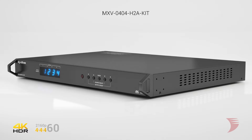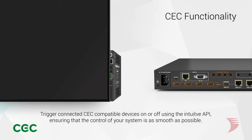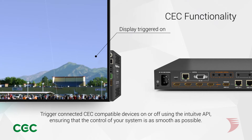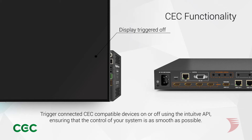While native HDMI properties like CEC are not conventionally found on matrix devices, WireStorm is always trying to bring something new and exciting to our solutions. That's why we've given this Matrix the capability to play a more comprehensive role. With the HDBase-T ceiling no longer a concern, the installer can be sure that the control side of the installation is equally as smooth, thanks to the Matrix being able to trigger compatible CEC devices on or off.